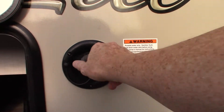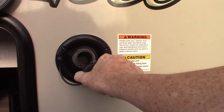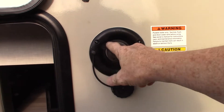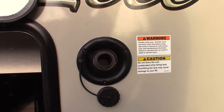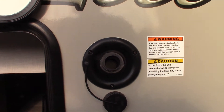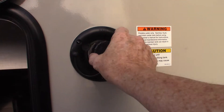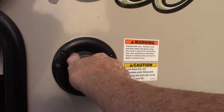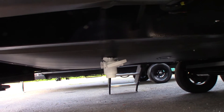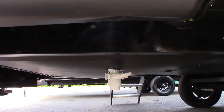The most common way to get water to the trailer is your city water hookup. This over here is for your fresh water tank — if you're going to a campground without plumbing on the site, you can prefill your tank here and use the onboard pump. To dump your fresh water tank there's a white gate valve right here — just pull out on it and it'll dump your fresh water tank.